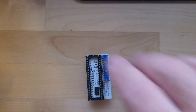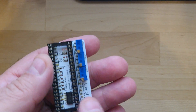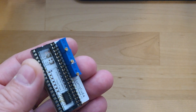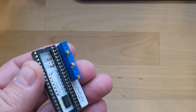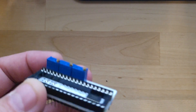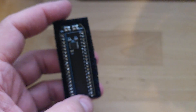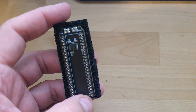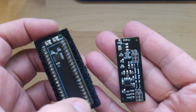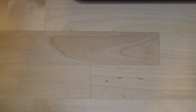There are two basic forms of cleaning the signal: one is where it's actually constructed, which is on the VIC chip, or fixing it on the modulator side after it comes out of the VIC chip. Then there were other iterations — there was the LumaFix, where you take the VIC chip out, pop the LumaFix in, put the VIC chip on top, and you had trim pots to filter out the luminance and make the picture cleaner. This was done on the VIC chip side, not the modulator side. A very similar solution also handled cleansing on the VIC side.